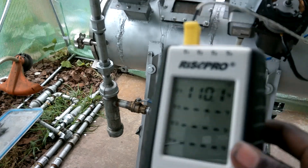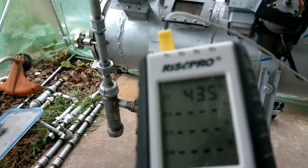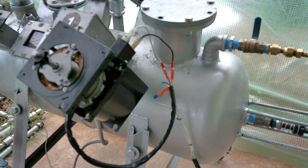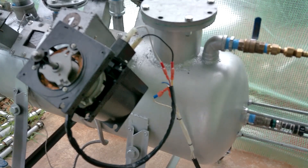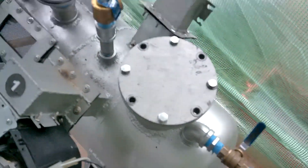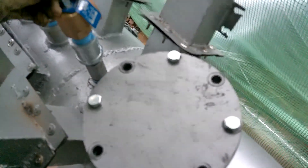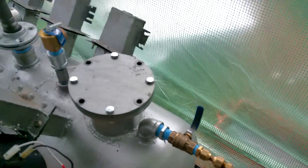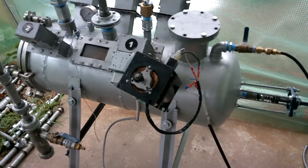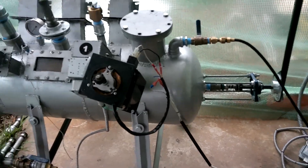Internal vapor temperature reached 110°F or 43.5°C. I've got all my safety gear on. I want to open up this pressure release valve for a second just to see what's up with this vapor — is it going to shoot out or what? Nope, not much — because once you turn the magnetrons off on a microwave pyrolysis reactor, the reaction really pretty much stops immediately. There are residual vapors, but it's not under pressure anymore.